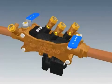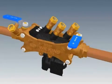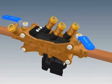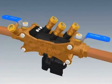Valves should be tested by trained personnel to confirm that your valve is working properly. Close your test cocks, then open your No. 1 ball valve slowly to pressurize the valve and inspect for any leaks. Open your No. 2 ball valve a small amount and wait for the system to pressurize. You can fully open the ball valve once the system is pressurized.